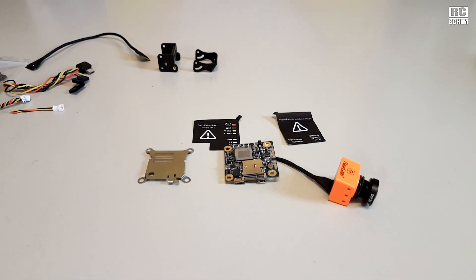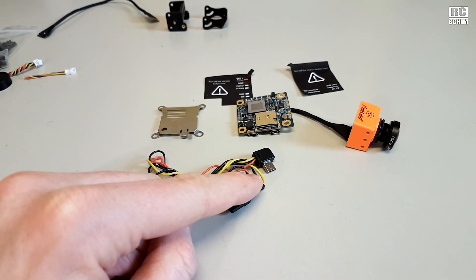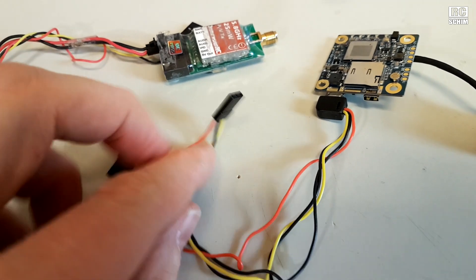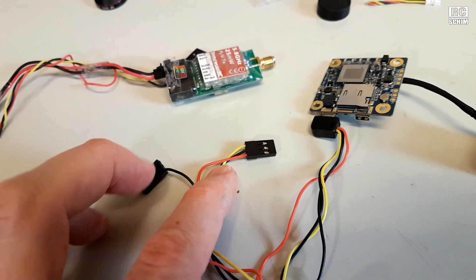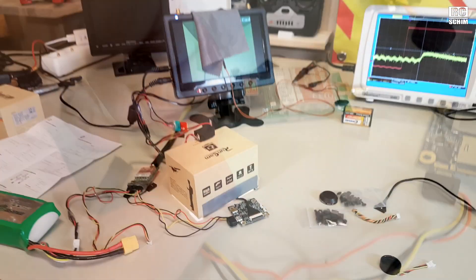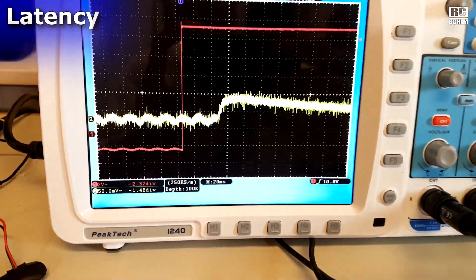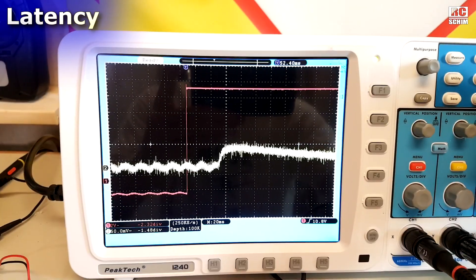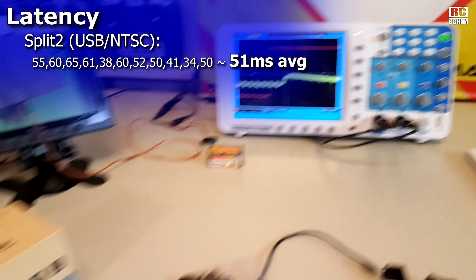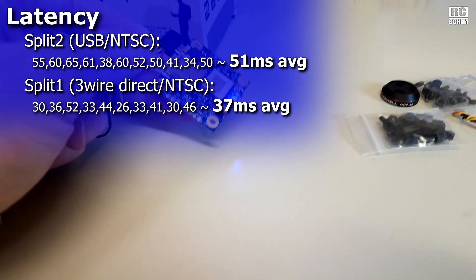Since I can use this USB connector, I will try a quick latency measurement with the USB connector — let's see if they brought down the latency as well. For the USB connector to work with my immersion, I had to reconfigure the cable — I brought the red wire over here and changed it, because I have 5 volt, ground, and video. Take care not to reverse polarity. Okay, hooked it up to my latency measure box. The typical result I got — the average was 51 milliseconds in NTSC and USB. It could be the case that the USB port is somehow slower than using the solder pads here.